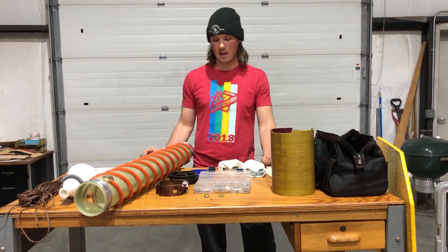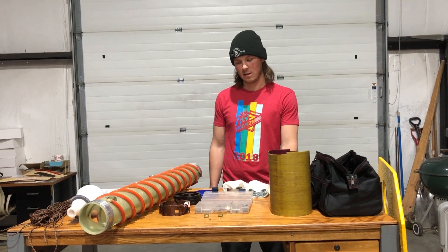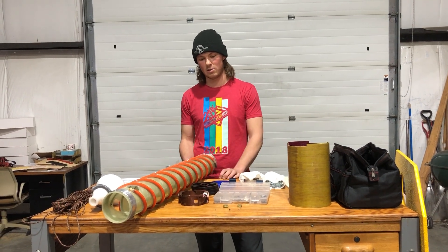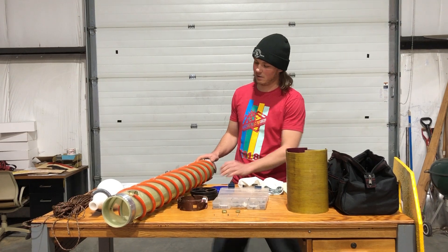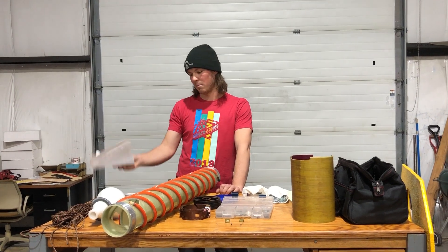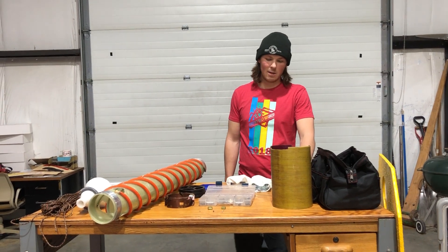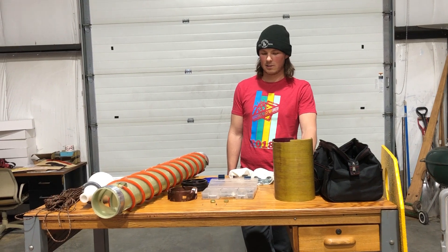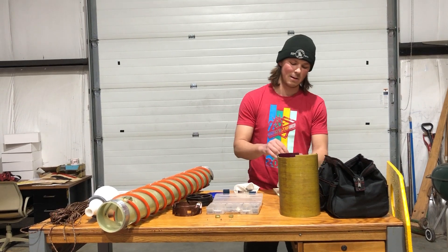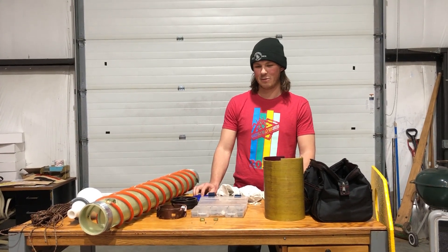When you're done hand augering, we really appreciate it if you can dry out your kits before shipping them back to Madison. When you're back in McMurdo or wherever, unpack your kits and dry all the components out so we don't get rusty, sad hand augers. Also hold on to your inventory sheet and double-check that you have all the equipment that was originally sent. For any questions, follow up with one of our IDP engineering team members or Chris Yoslawney, and we'll be happy to help. Thanks for watching — stay tuned for the next installment.